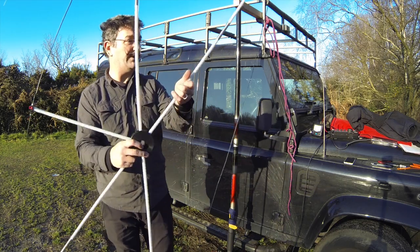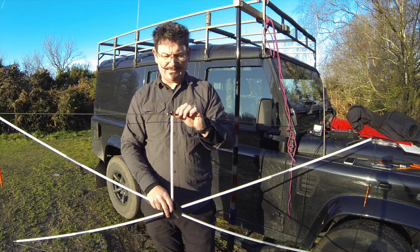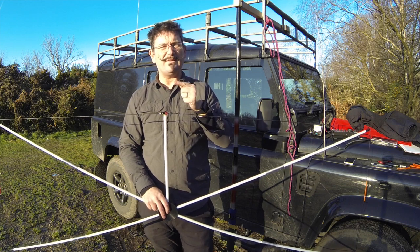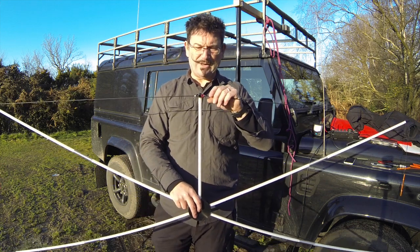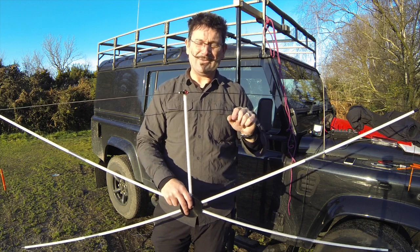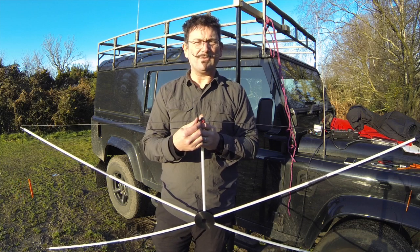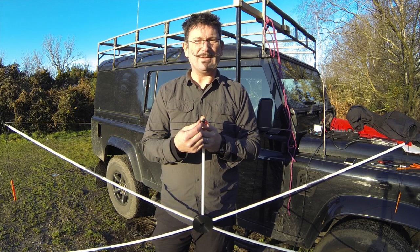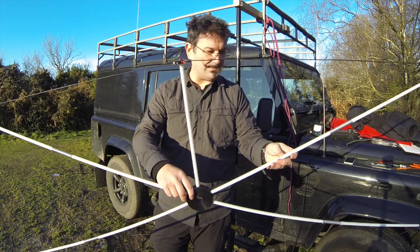You may also be tempted, when you bring those two soldered lugs back to the connection point, to cut those rings and make them into hooks so you can just hook them over. But actually there's quite a lot of pressure on that - it's quite tight. It does mean you have to unscrew the binding posts completely. I'm always a bit dubious about doing that on a hillside with cold fingers, but they're fairly big and substantial so it shouldn't be too bad.